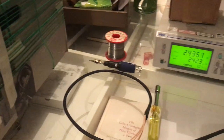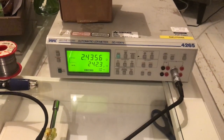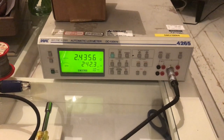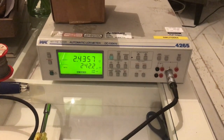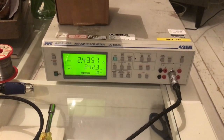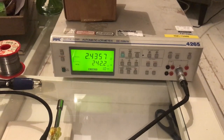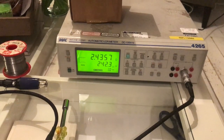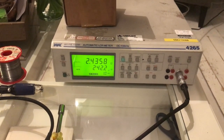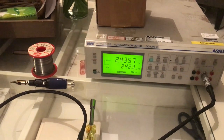That means when I wire up the tuning capacitor and plug this into my SDR antenna input, it should have the correct bandwidth for medium wave. I thought I'd share that — I don't know if it's possible to buy a cheap inductance meter, but this is a really good one and luckily we don't have a lot of use for it right now so I can borrow it. Whilst my interest in building induction loops continues, I've got a means of checking the inductance of the coils I'm winding. I'm going to attach the tuning capacitor, wire up the BNC connector on the extra pickup coil, and see if this confirms the bandwidth is suitable for medium wave. Thanks for watching.